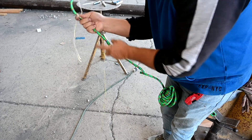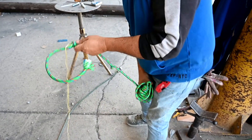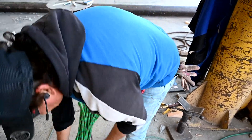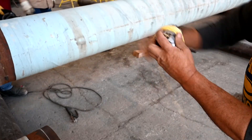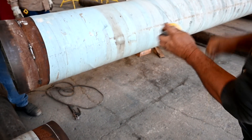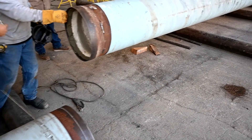While the cement starts to firm up, we need to start preparing the wiping line. The first thing we need to do is feed a rope through our 40-foot section of pipe. There are many ways of doing this, and in this example we are going to use the guide string method. We are taking a weighted ball wrapped in paper to protect the lining of the pipe and chucking it 40 feet down the pipe.